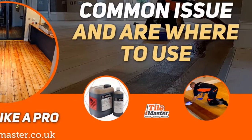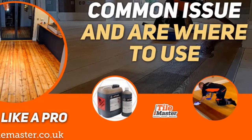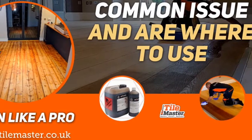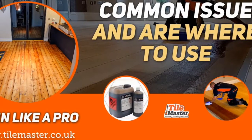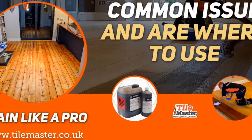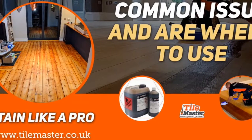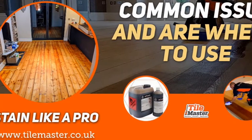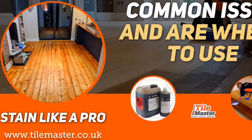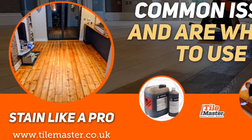The two main issues with stains: one is that you can get overlap marks. If you apply one coat to a board and when doing the board next to it you overlap back onto the first board, that board will end up slightly darker. So you need to work board by board. The second issue comes from your sanding — if your scratch pattern isn't perfect, stains highlight everything, and any little imperfections or scratch marks will show up when you apply the stain.